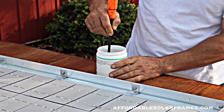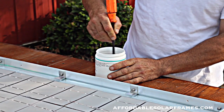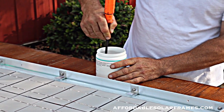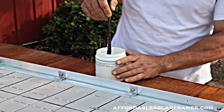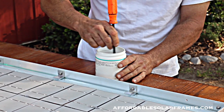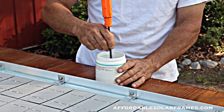Summertime, this stuff will heat cure. You've got about two hours or so to work with it. Don't get in a hurry — just take your time. You don't want to mix it violently and whip a lot of air in; just stir it slowly. You don't have to worry about being overly thorough.